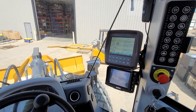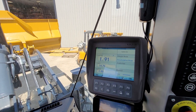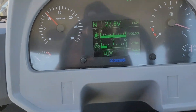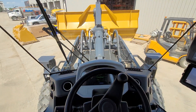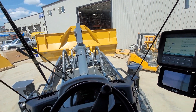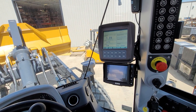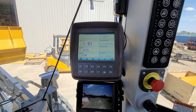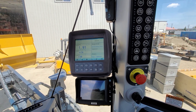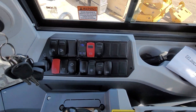Just for the sake of it, let's test it. I'm not going to use auto lift — I'll just keep a steady speed. It reads 1.91 tons. The oil temp is probably not where it needs to be, and that's where that 8–10% variance is going to come from. But if you follow that procedure with a properly warmed-up machine and accurate weights, that is the process — and it's quite simple. The biggest challenge is just finding something heavy enough and convenient enough to load with the bucket. I'll have a couple more videos on these machines for my City of Edmonton guys — really excited to show off all the stuff we can do with these.